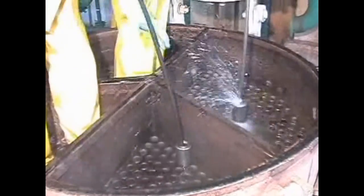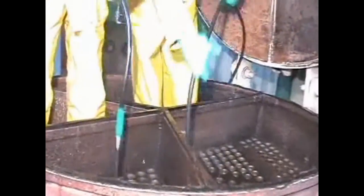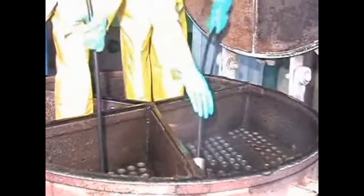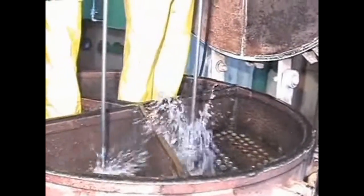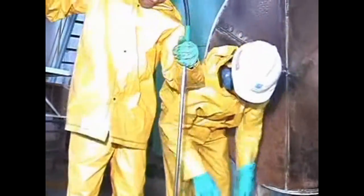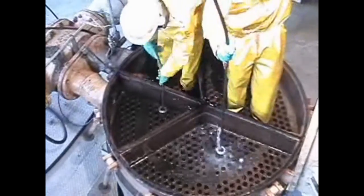Due to the necessity of internal cleanliness of the tubes, suitable accessories are used, such as lances with protectors and rotating nozzles. In general, an operator using one lance can clean approximately 500 tubes per hour. In the general area of the evaporator, two or three operators can work at the same time.